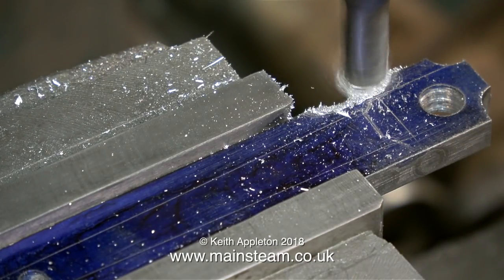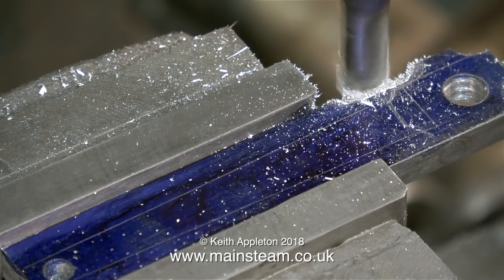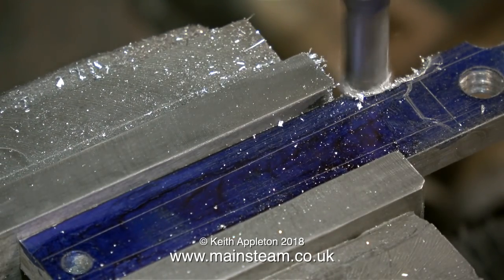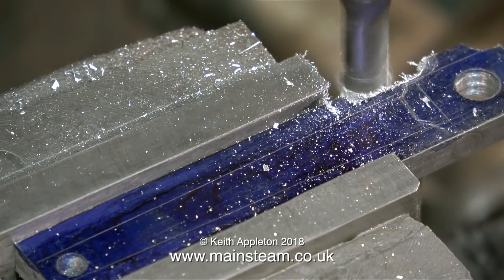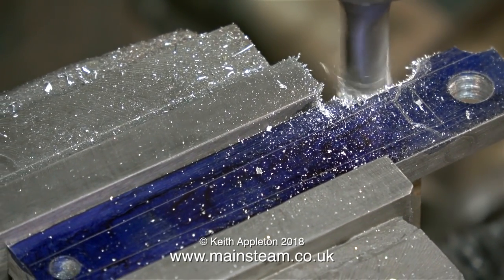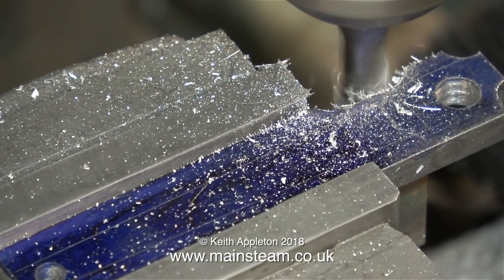In the case of this particular operation I have to be very careful, because the milling cutter is not cutting against the work when it gets to the end of its travel on the right-hand side. That's why I haven't cut up to the line. Once I've machined some of this material away, when I machine the curved part at the right-hand side I'll revert back to using very shallow cuts — many of them — or this will happen.